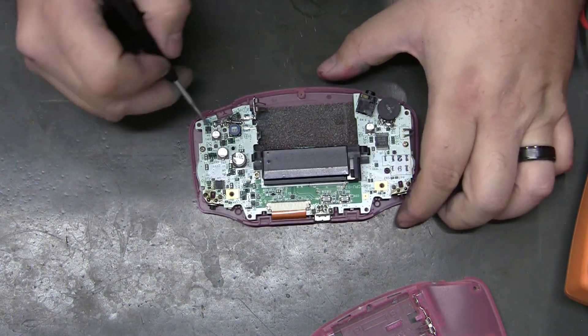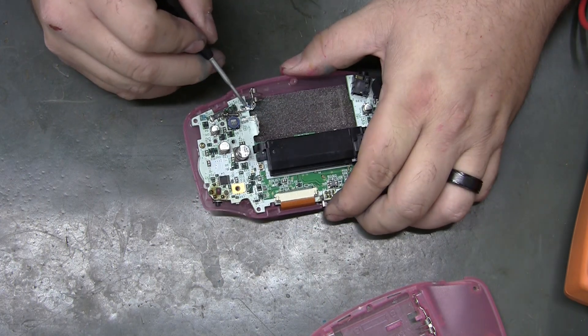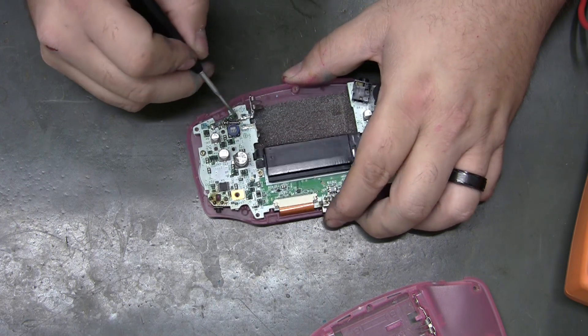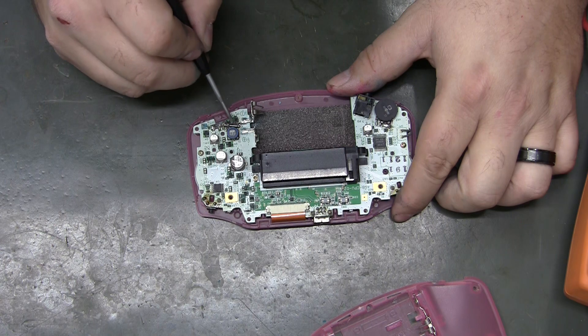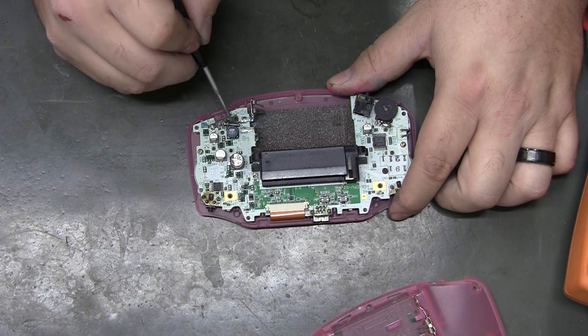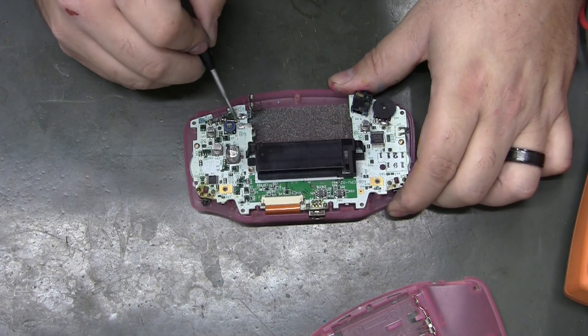A tidbit on the power switch: this one was corroded — you can see corrosion around the battery contacts. Apparently a battery had vented. When I went to do the power bypass, the very far left pad basically pulled off, some of the plastic had broken and disintegrated, and when I took the top off and wiggled it, that pad came with it.